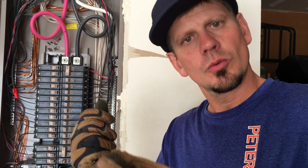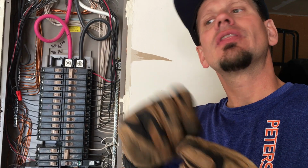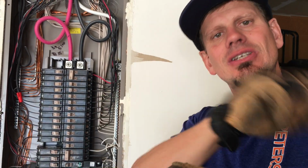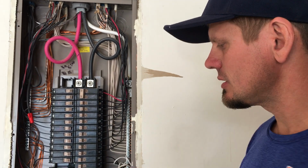You really have to find the beginning of that circuit to the home run to the panel, then start dissecting your neutrals, then dissect your grounding EGC bare copper conductors. Once you separated all those power switch legs going out, maybe it's just a can or a thermal fuse blowing, who knows? But the point is that you can use a couple methods. Use the light bulb that just plugs in, use a light bulb that has the test leads, use your multimeter, use your toner. I used all 4 meters, that I call meters, on this, and it worked well. It sped up the process.